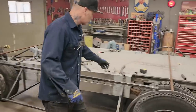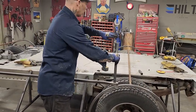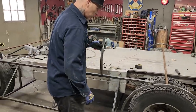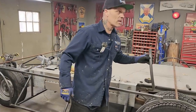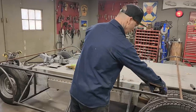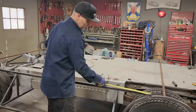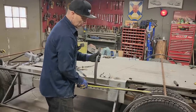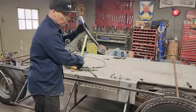And then we can do the roof. That's what we're going to do. Then we can lay each one off the roof, and we'll probably do every 2 feet. The reason being is our metal is 4 feet wide when you buy a sheet of metal. And 2 feet seems like a fair distance. I think some buildings are every 2 feet. So we run a roof structure there, one there, then another 2 feet, and so on, and so on.